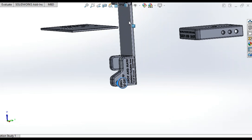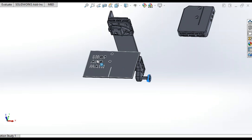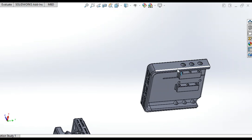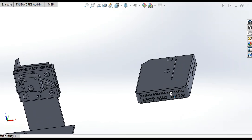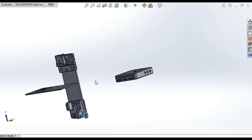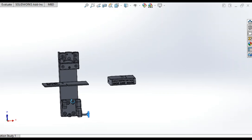This is 3D printed plastic with a piece of angle channel with two holes drilled for mounting on the scaffolding. There are two table top options. The 3D printed one uses a pinching concept and a bolt-down concept — tapped holes would grab the guide rails and the table slides on with the blade intact. The skirt around it gives rigidity. But if you just want to get your saw up and running quickly, the 3D printed table works. The aluminum plate is better — I have videos of machining it. The nice thing is it bolts on nicely; the only trade-off is the saw blade has to come off to mount it, which only takes a minute.